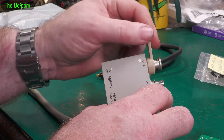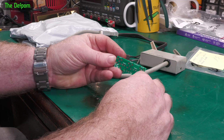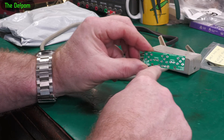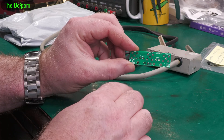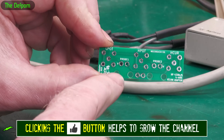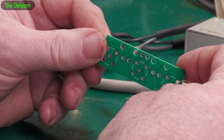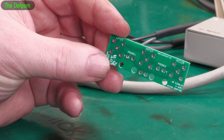You can download and print the levers yourself and push them onto a standard BNC. So that's to put onto my unit. Once you've got this thing populated, you can run some wires to it — it's got cable tie mounts so you can run cable ties through those, run some silicone cables up to the device you want to measure. You can run some 4-wire cables off it with the high and low connections right there, and cable tie holes to keep it tidy. Nice and easy, nice and compact — maybe you'd want a 3D printed cover to go over it as well.